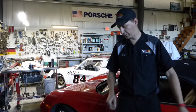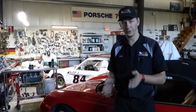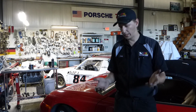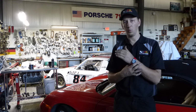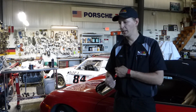So as you can see, I think the point's been proven. The variation between our 2 torque wrenches is basically nil. That really proves the point. Being on axis is much more important to whether you actually have an extension or not. The extensions will twist, and the amount of motion that you have to put in will be more when you're using an extension, and varies based on how much extension you have, obviously.